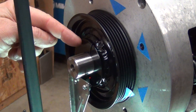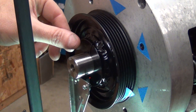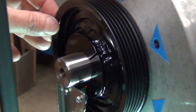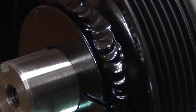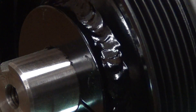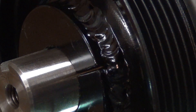Initially, I'd only put one magnet every 90 degrees in here, and it would have been half the duration of the pulse we're seeing. It's because of the strength of the magnet. So I went back and added a second magnet next to it. You can see right there — this magnet and this magnet. They're just pellet-shaped magnets in a depression that I had milled into the pulley's material. I dropped them in with some super glue, painted over the surface, and we have a pretty nice finish.